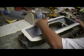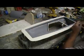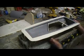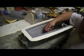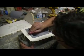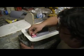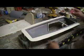When I lay this part up I'll lay it up with these two parts bolted together just like it is now. Then when I take it out of the mold I'll take these two bolts out, and I won't have to have a piece of seam tape in the middle right where I'm putting my canopy.